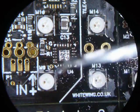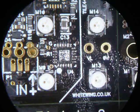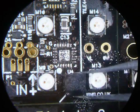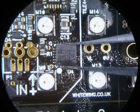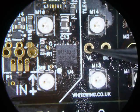Take your chip, making sure it's actually the right way around — you can't see it because there's solder paste all over it. Place the chip; it doesn't have to be super precise at this stage, just get it as close as you can.